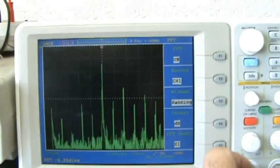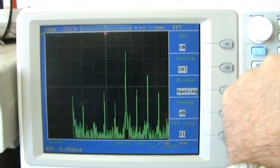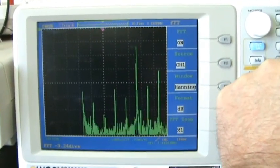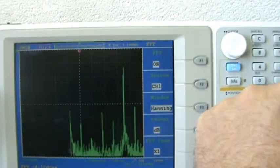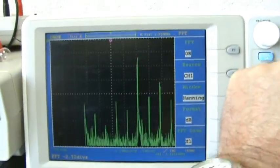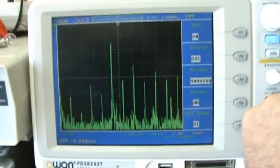And we have more frequencies over here. A little spike over here, 4.4 megahertz. Another one here, 3.25 megahertz. Something here, 2.2 megahertz. And I have here a nice spike, it is the 1.1 megahertz. But this is where my function generator is at the moment, so this is the frequency of my counter. So also here I do not see any clear evidence of a 1 to 2 megahertz frequency.